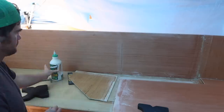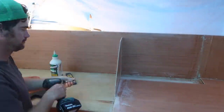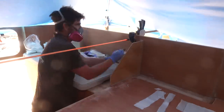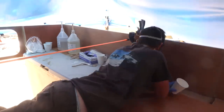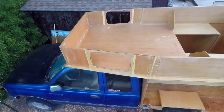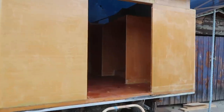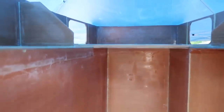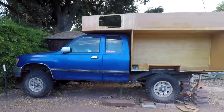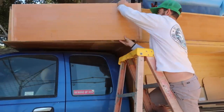Finally, I added these little sections of 5-millimeter plywood — glassed on both sides and glued, screwed, and glassed in place. They will keep the mattress from sliding off the cabover, provide some separation between our bed and cooking surface, and act as a gusset for the pop-up wall. That completes the cabover and thus the entire permanent structure of the camper. It feels pretty good to be able to walk inside and feel like my vision is progressing towards reality. Thanks for watching — join me next time as I work on the outer pop-up walls and the roof of the camper.